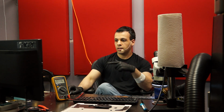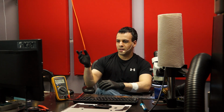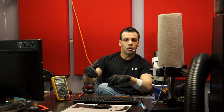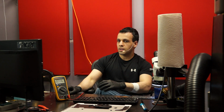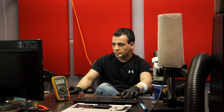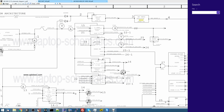Now, I want you to look at the nomenclature. Is that the right word? Naming here. If you look at the name here, the SMC reset signal ends with an _L. That means that the reset signal is going to be asserted so long as it's low. Now, let's try to get an idea of what low or high would mean here by going to U5010, which is that signal.